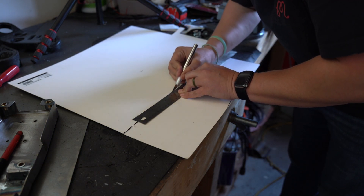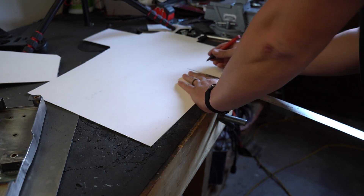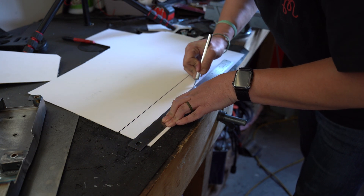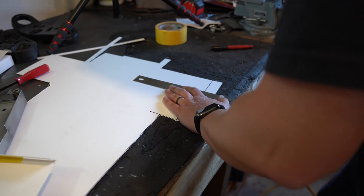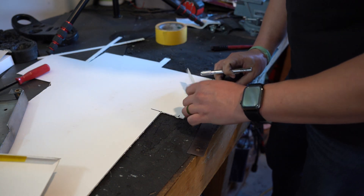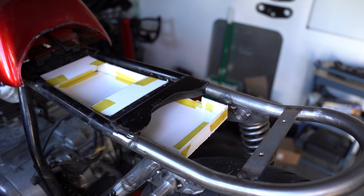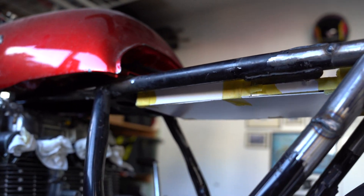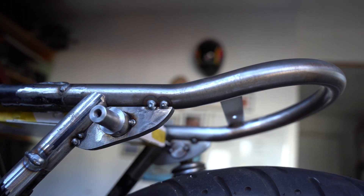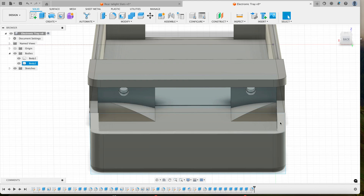It's not as flimsy as cardboard and it's a lot more rigid but a lot thinner. I really like using this material. Mock-up is super important when making any sort of part — it saves you time, it saves you filament if you're 3D printing, and honestly just frustration. Even if I do a fast 3D print it still takes a long time, so if there's a mistake I can catch it, check clearances, make design changes as needed. Plus it's super cheap and really fast, so always a must.